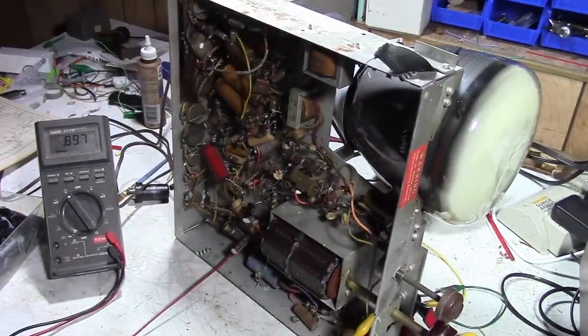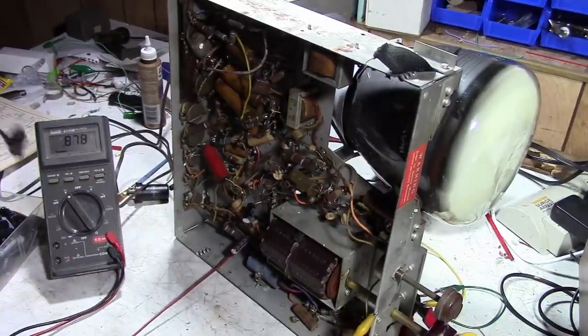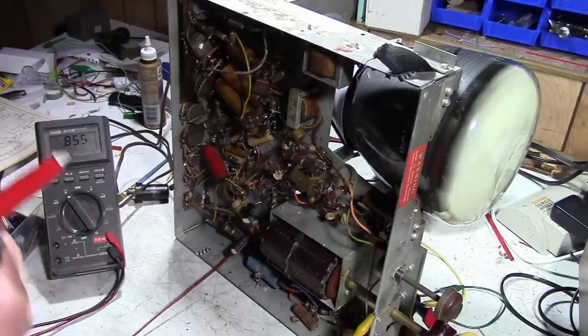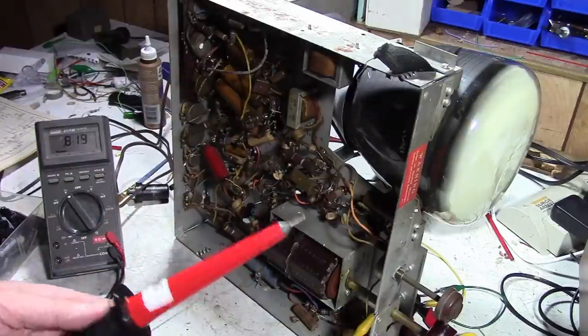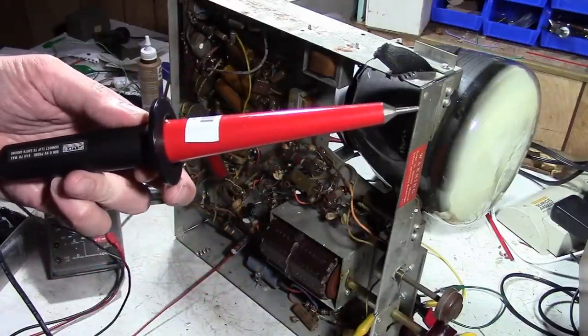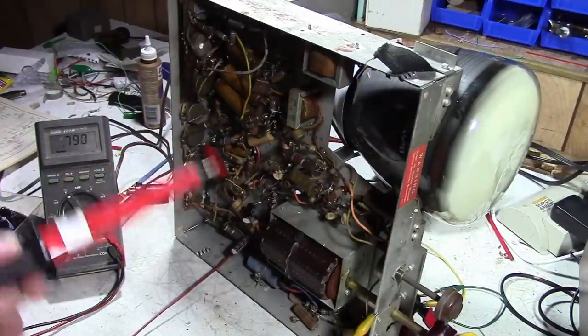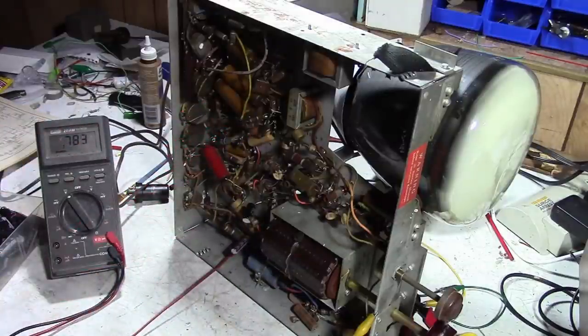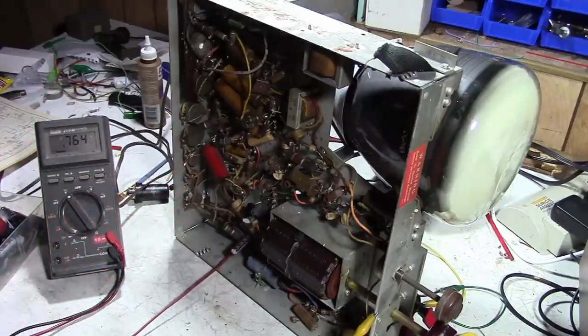So many of you guys, I'm sure, have seen this Fluke 27 meter. Well, if you got it off of eBay as surplus, they often came with this. This is a 6,000 volt probe, which probably most of you have never had any use for. It's just high enough to use with sets like this. Every other TV I work with, all the ones that have flybacks, I'll use 10,000, 8,000 or more. I can't use this. But with these sets, I finally get to use it for something.